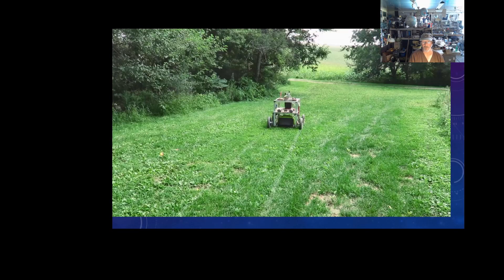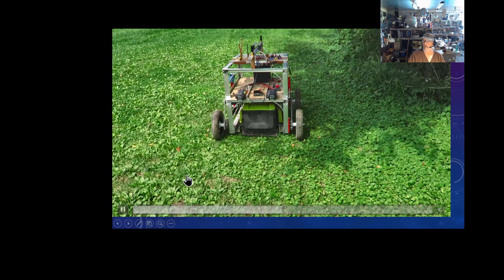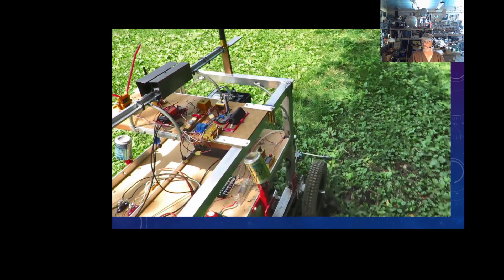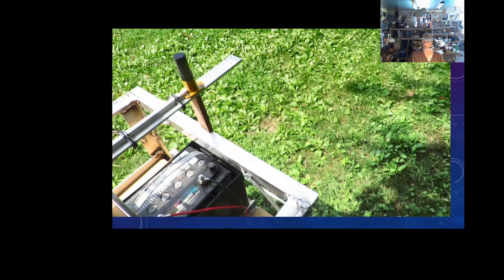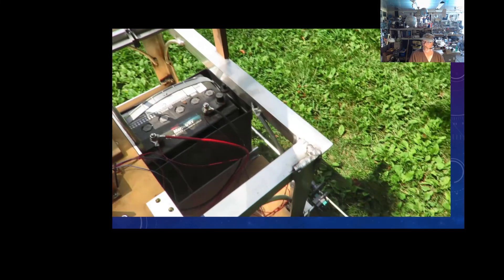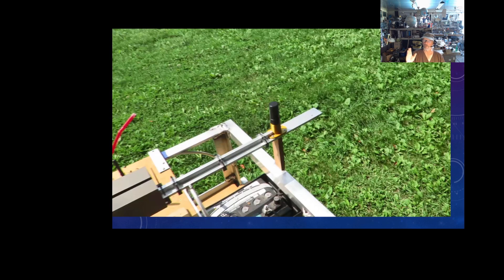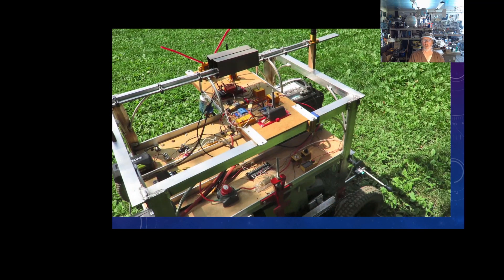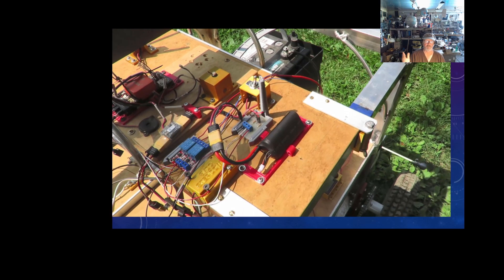This is running at 300% — like watching paint dry. It went to the first waypoint, started the mower up, and started the mission. I've never had it drop RTK under trees, which is interesting. What I'm doing here is taking this can off and setting it right on top of the antenna. The mower stopped mowing, the blade stopped, it switched to manual mode, and it's going to wait right there until it reacquires the RTK. Okay, I took it off — there it goes.